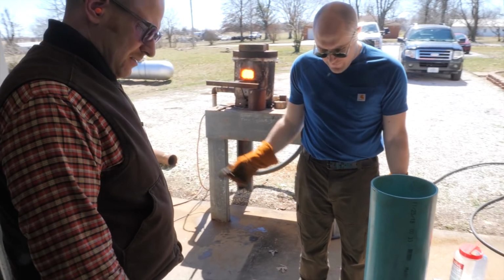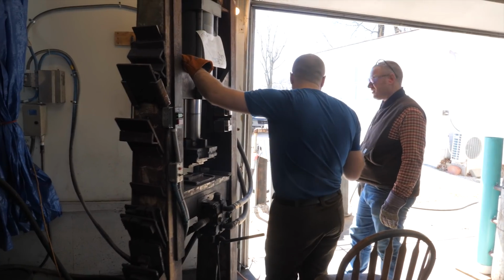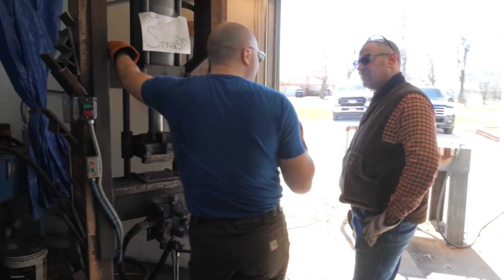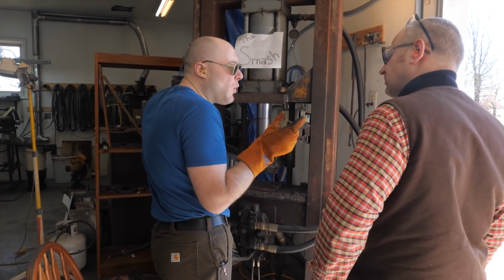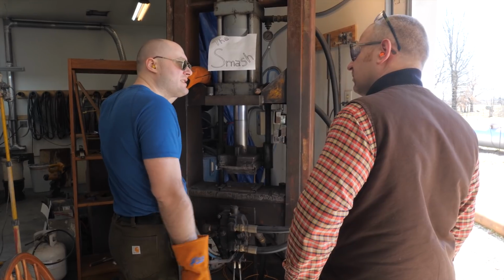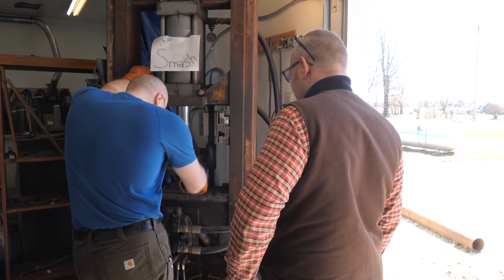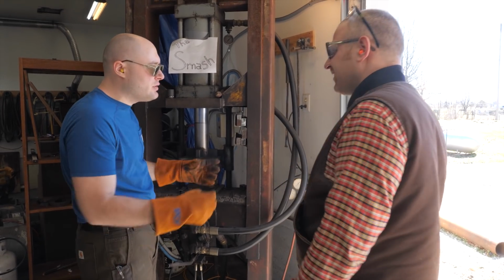So it's 24, we folded it once. Yeah, 92. Turn the forge back up a little bit. Normally for a multi-bar twist, I make like a 5/8 or maybe 3/4 inch bar at the biggest. But since we're going to get one blade out of it, I want to try to make it bigger because it's going to take more mass to make it wide enough. I'll forge it to 1 1/4, see what that looks like, and if I think it looks a little big, then I'll do it down smaller.